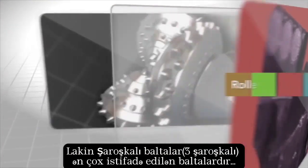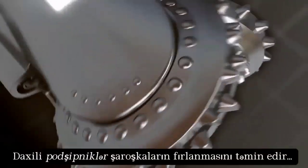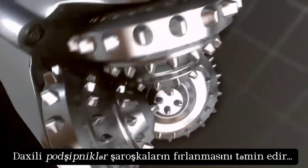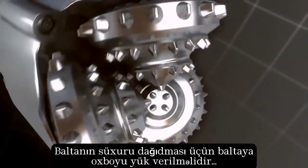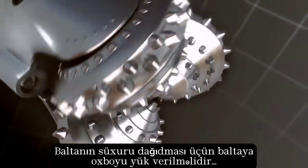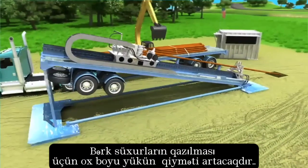There are many types and designs of bits, but roller cone or tricone bits are the most common. Internal bearings allow a roller cone bit to rotate freely. This relieves torque from the drill string as the driller applies forward pressure or weight to the formation. The harder the formation, the more weight required.